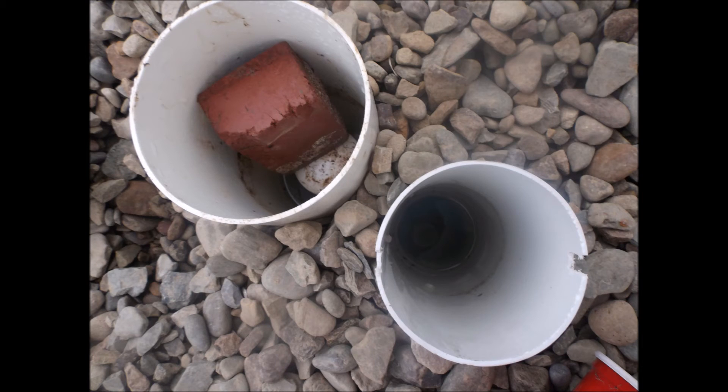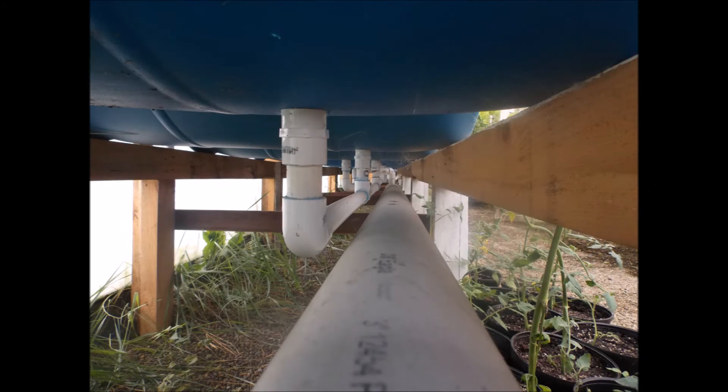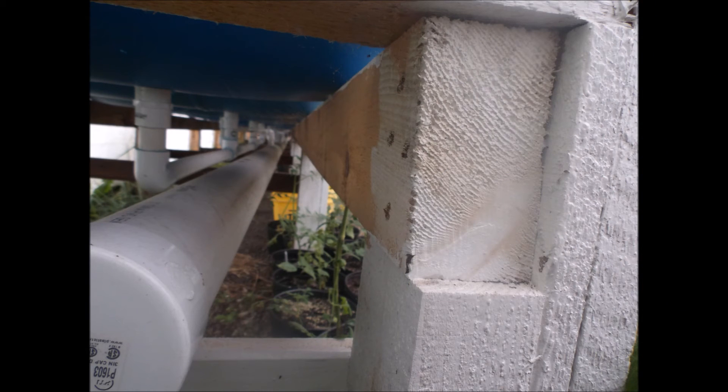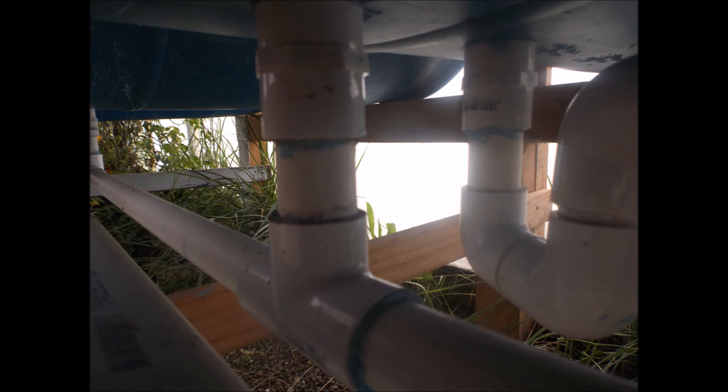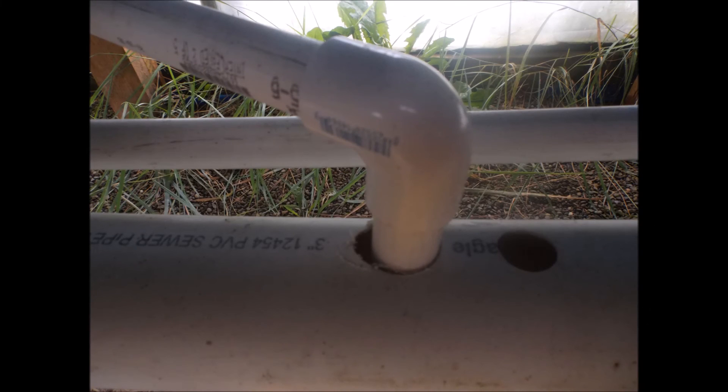This tube protects the drain that connects the barrels together. These are the interconnecting barrel drains and the bell siphon drain. You can see the plumbing connections underneath the barrels. Notice to the right here the 2x4 that's holding the weight of the barrels — how it's supported and the weight is transferred to the ground. The weight of the barrel is directly on the 2x4. This is a picture of the inner barrel plumbing connection and the P-trap. The P-trap connects directly into the main drain that runs into the sump tank. This is the 1x3 support that's between the two barrels — this keeps the sides of the barrels from caving in.